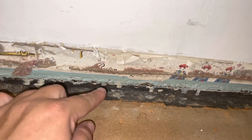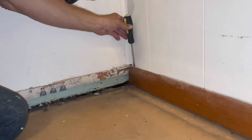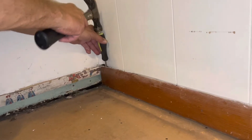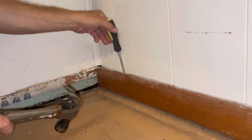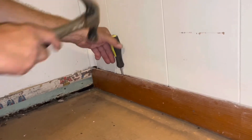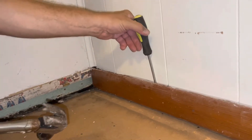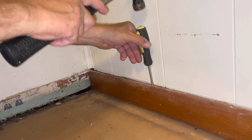Anyway, I'm just showing you this because we're taking up the baseboards — you don't know what you're gonna find underneath. We're getting a shop vac and getting all of this out. Now let me show you how I'm getting the baseboards off — flathead screwdriver, tapping it with a hammer. You've got to be really careful because you don't want to break one in half unless you're putting in new baseboards. Just do that every few inches.